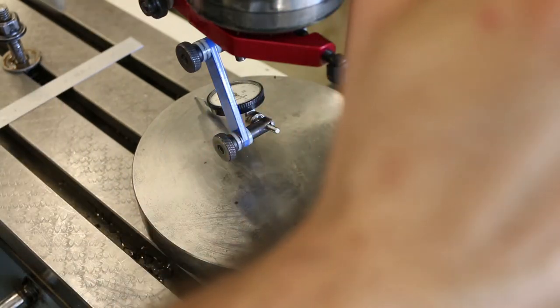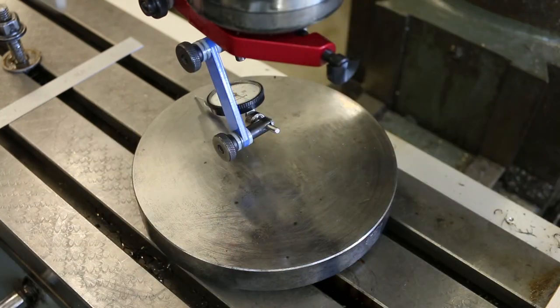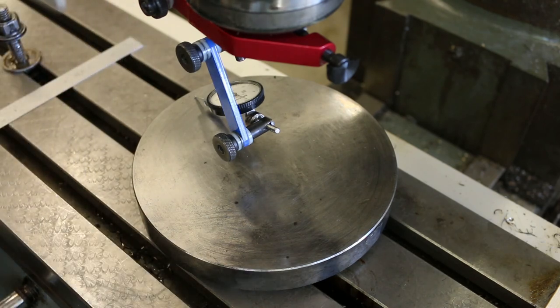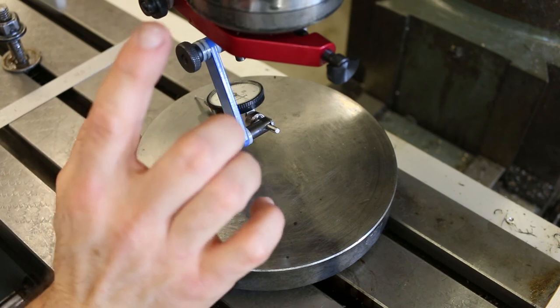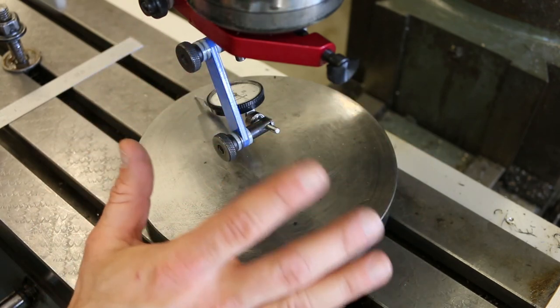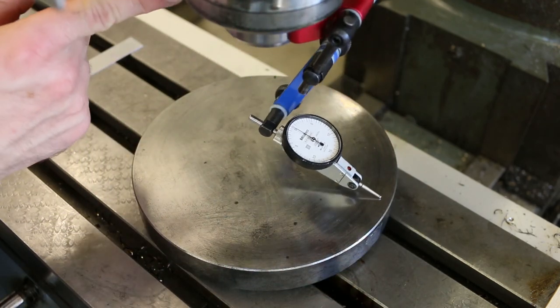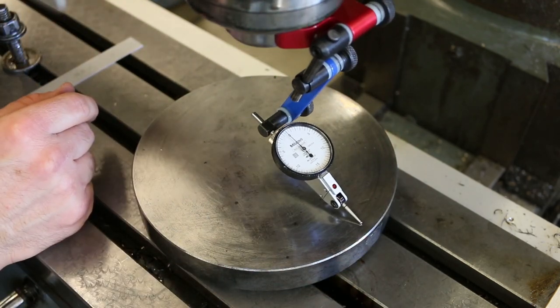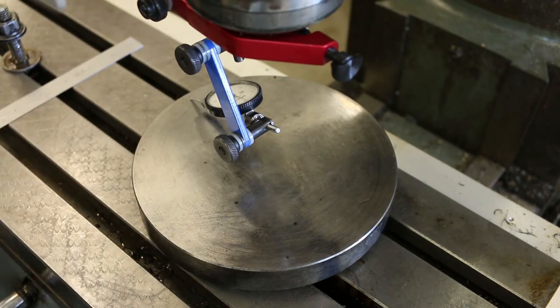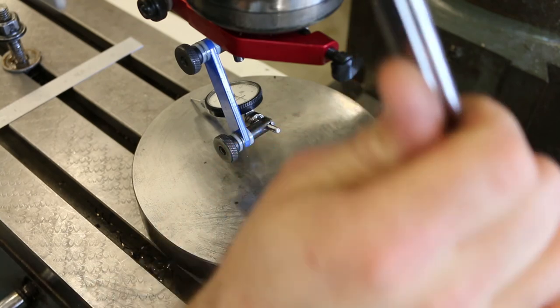So I'm going to go ahead and snug these bolts back up on the front, and I'm going to use a star pattern, meaning that I'm not just going around the circle with these four bolts, but going across the pivot just so I bring everything up nice and evenly. And I'm actually not going to tighten this down all the way because when you clamp things down, they have a tendency to move out on you. I'm going to come out here and just double check that I am where I want to be. And I'm still within tolerance there. So now I will tighten this 100%.